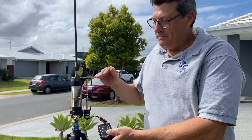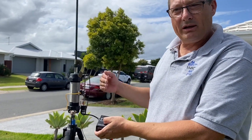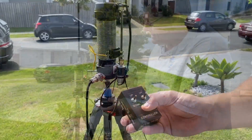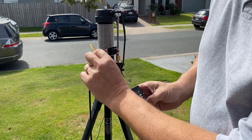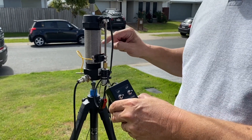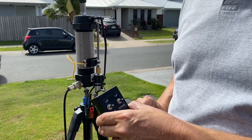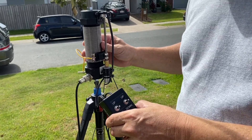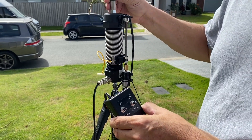How do I know what position it's in? Well, that's probably the hardest bit. Because this is not one of those servo motors that gives you feedback on exactly where it is — it's just a very simple motor — I utilise timing. I've lowered the coil to the 40 metre band, which is more towards the bottom of the coil. I've got some markings along the coil which I can visually see to know approximately how high the contact needs to be for each band. This coil is basically the same length as the Mad Dog Junior, and it can tune up on 40, 30, 20, 17, and 15 metre bands with the current whip length on top.